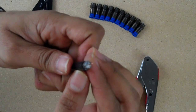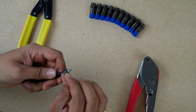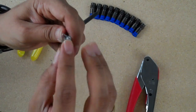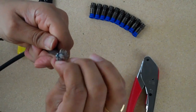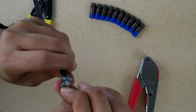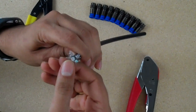This is going to expose the braiding, and there's going to be some foil there as well. What we're going to do with this braiding is we're going to fan it out like a flower. Fan it straight out. The more time you spend with this part, the better the connector is going to work and connect to the cable. You want it to be evenly distributed, no lumps.